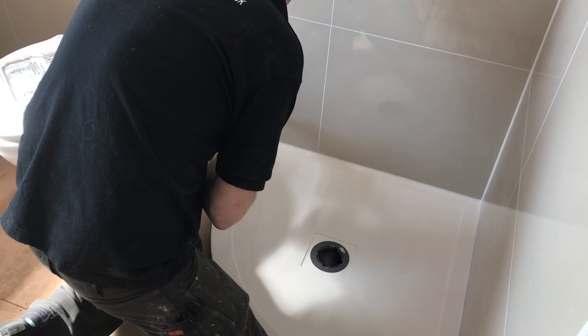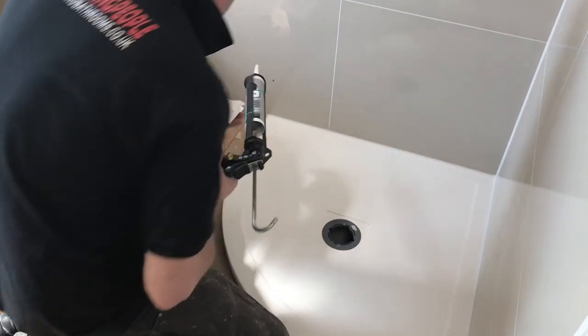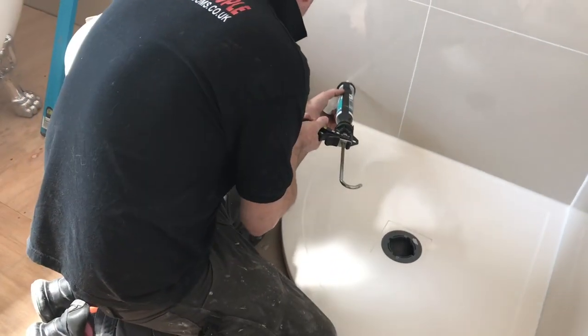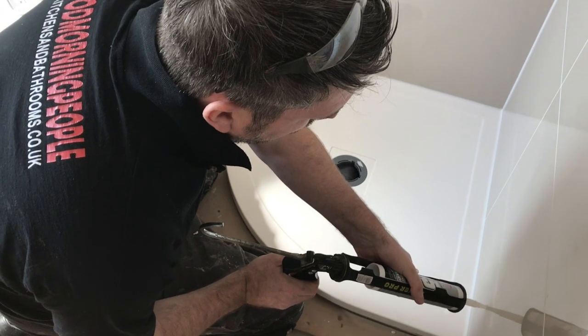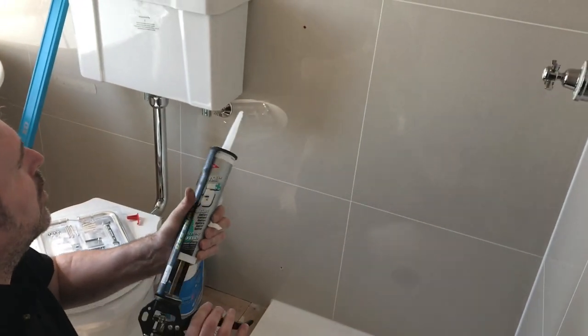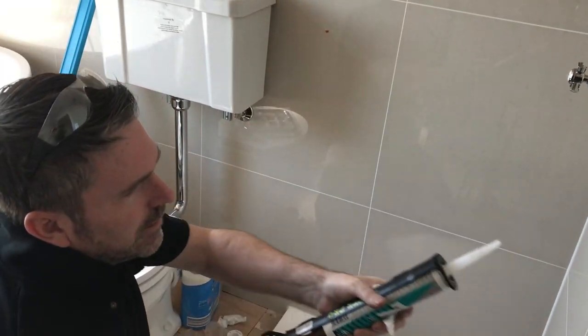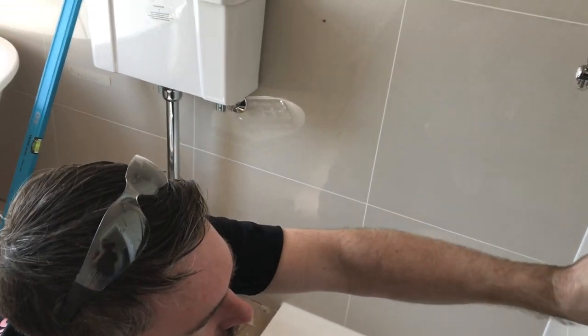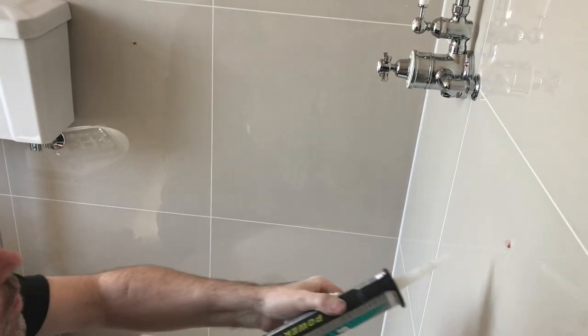You've drilled yours. And if you're lucky enough to have bought the Bosch MJC tile bits to make it easier, make sure you always silicone the holes. There's already red plugs in there. Make sure you get a nice dab of silicone over the hole before you do anything.